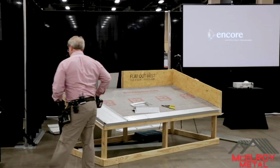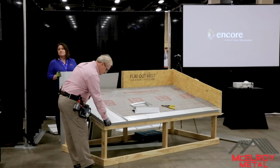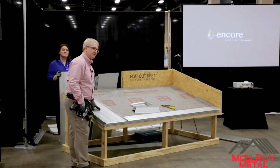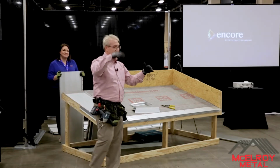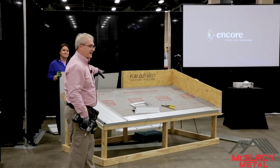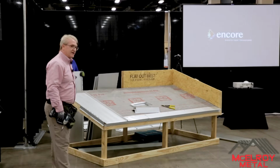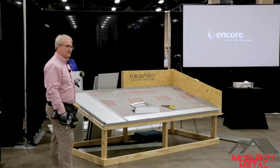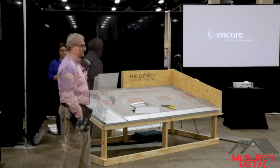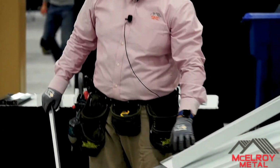One thing that I like to do when I'm doing a roof like this is I always want to make sure that I'm actually working on this panel. So imagine you're on a roof, right? You're 10 feet off the ground. I always like to get my panel on first, my first one started and set. I'll finish my rake while I'm there, because I don't want to get all my panels on and then come back and walk on a painted surface. Okay? So you see this trim piece right here, it's a rake trim.